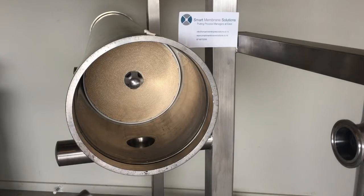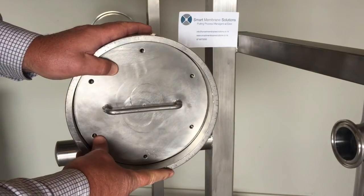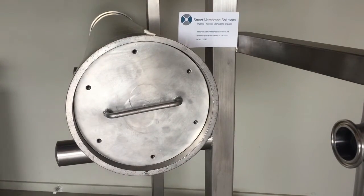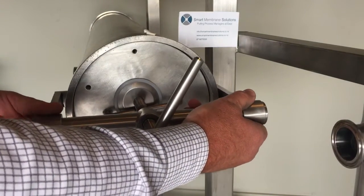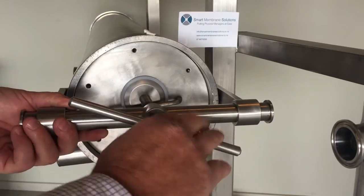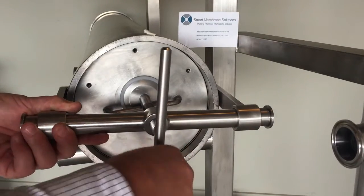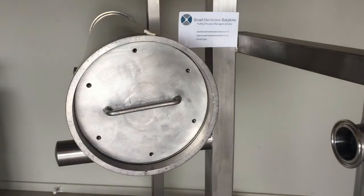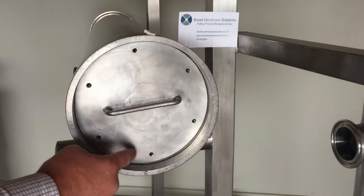Okay, let's show you how the compression tool works. Membrane's in, ready to go. Let's get the feed end plate in, put it in position as best you can. The compression tool has an adjustable arm, so you just want to slip that in here, pull the sides in evenly, and then slowly wind it in. A lot easier than using hammers. Once it's in you just release it — simple as that. It's now ready to put your retainer plates or retainer shim springs in, put your lugs back on, and you're good to go.